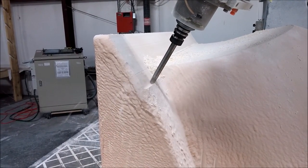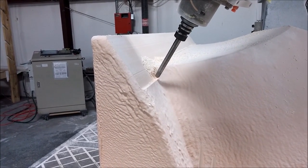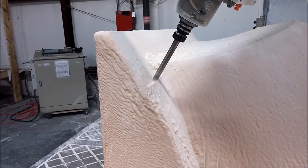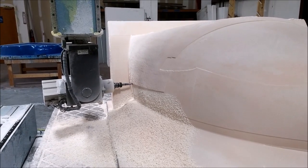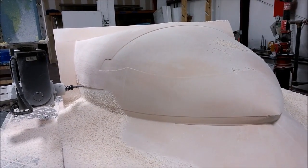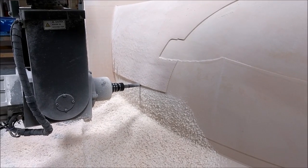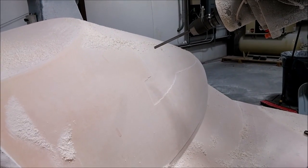Here I'm cutting the side flange on the right-hand side. Because it's so close to the fuselage itself and the angle was pretty tight, instead of using a flat mill I'm using the ball mill to cut it on an angle and get in there — it takes longer and doesn't give as smooth a finish, but it's good enough with some sanding. Here's the last face cut on the right-hand side, already started at the bottom where the joggle is, working its way up. I cut it into front and back because of the number of different parts to that path.